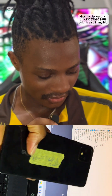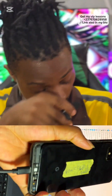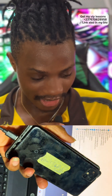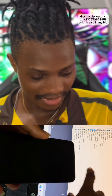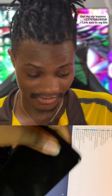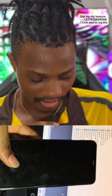Now let's go to the one with the CPU fault so you can see the difference. Connecting it to my PC — as you can see, no detection. It doesn't detect because the eMMC is okay; the CPU needs reballing. That's the key difference.